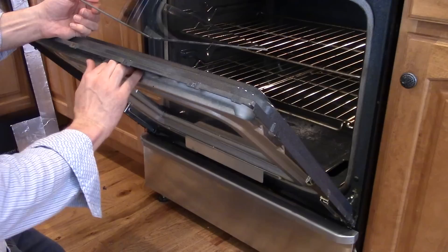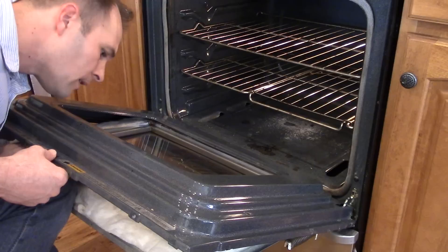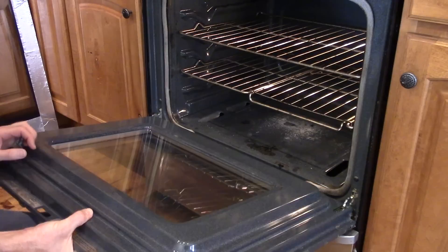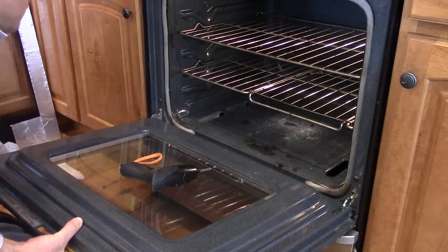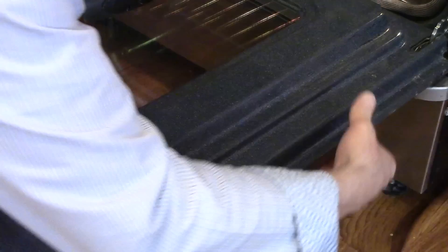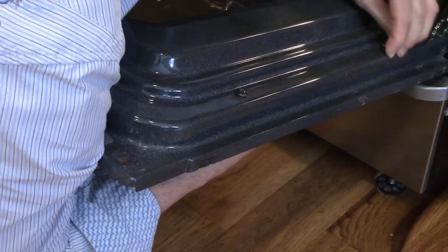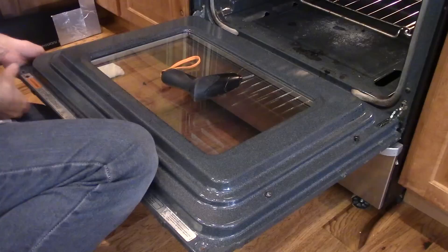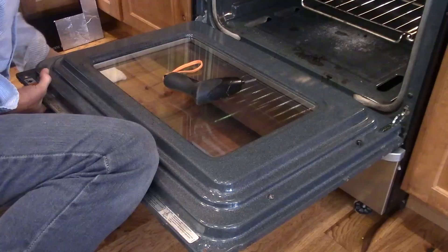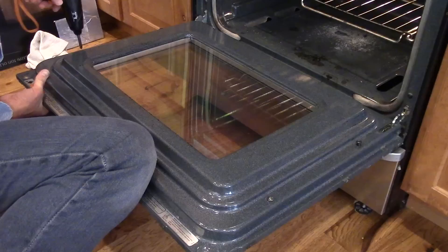Now the second piece of inside glass — I'm going to use my knee and lay it inside the metal frame. Now the screws — like I said, these are the four screws that go around this side here. What I'm going to do is tighten them all at once, so I'll put each screw in first so I can get the holes lined up on all sides. Otherwise if you put in one screw and tighten it, it sometimes makes it harder for the next screws to go in because you can't move the parts around. There we go — put in all four by hand and then just tighten.